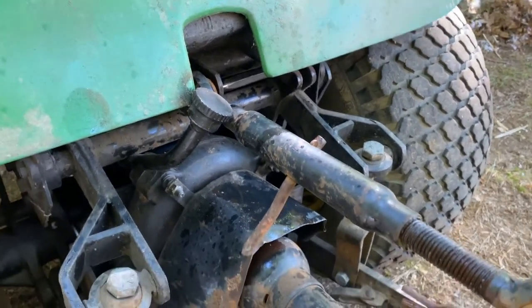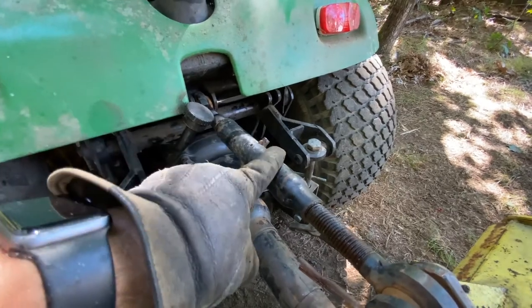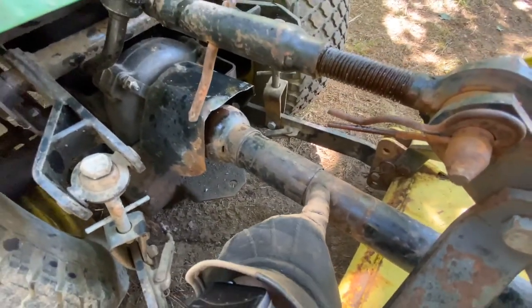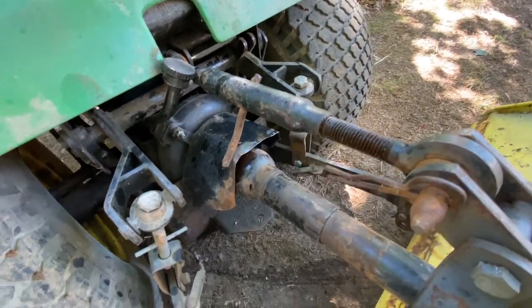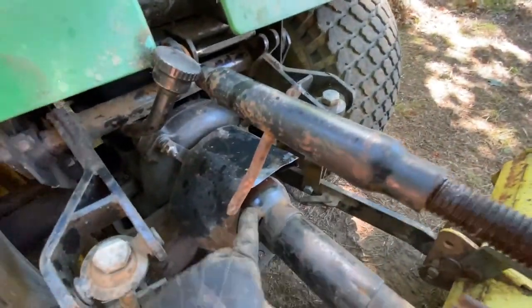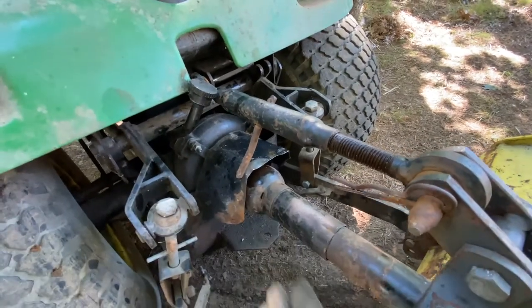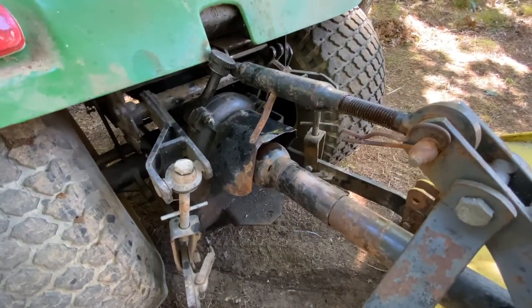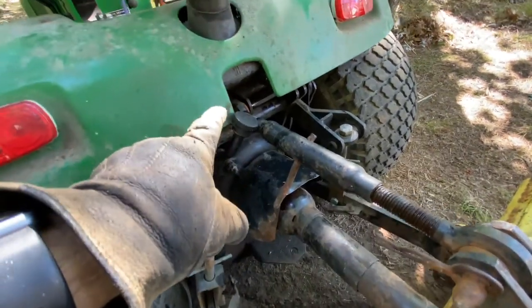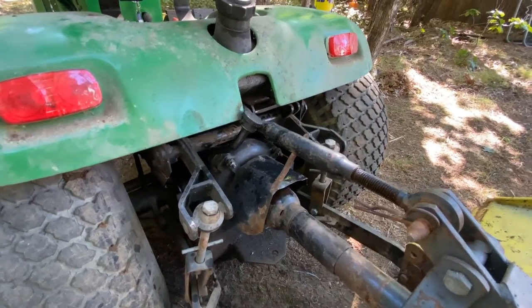As I said, we've never had this thing on before, and we just realized — I mean, I've done three-point hitches before, but I just figured this was set up correctly. This is actually not long enough for real — it's too short. What's happening is it's bottoming out the shaft in here and forcing this up against the transfer case really hard. When I noticed that, I can't fix it right now because I've got a temporary pin in there. The bearing on the transfer case is all worn out, and if they had this pulled so tight that the shaft was all bottomed out, pushing pressure on that, that certainly would cause that issue. So I've got a temporary pin to hold it from turning and I'm going to put a pipe wrench on this and try to get a little more length so we can get the actual pin in and loosen it up. It's pretty close to where it needs to be, but it is going to need some fine tuning before we're done.